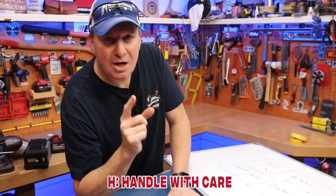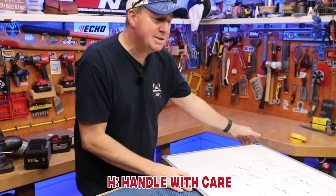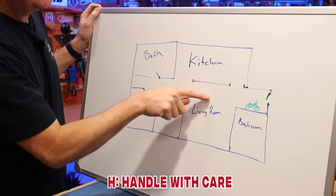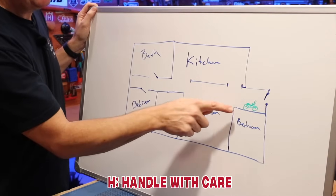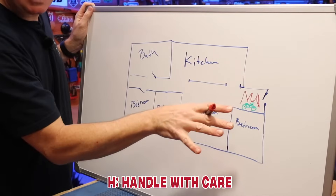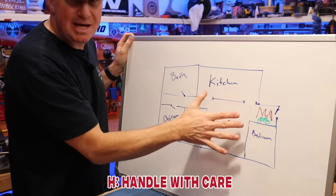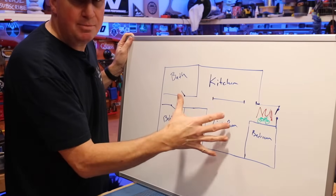Another important thing is not to charge your larger devices — like a scooter or e-bike — next to an exit path. In apartments, this is especially important. Looking at a typical three-bedroom apartment floor plan, there's often only one exit, and that entry area might seem like a convenient spot to charge your e-bike. But if that were to catch fire, it blocks your only exit — a very serious situation if you're on a second or third floor. It's best to charge these outside of living space if possible, and don't charge overnight if you do bring it inside.